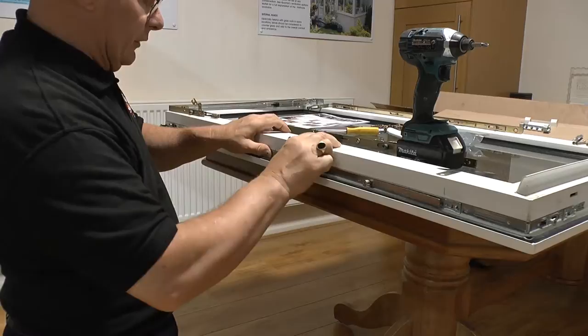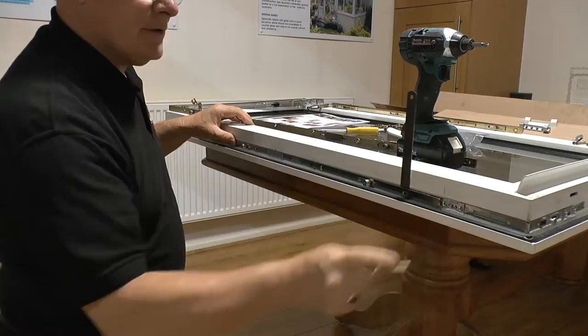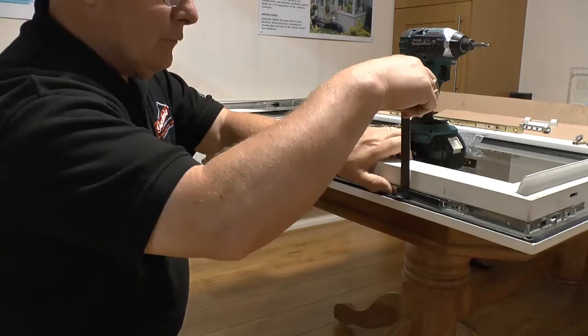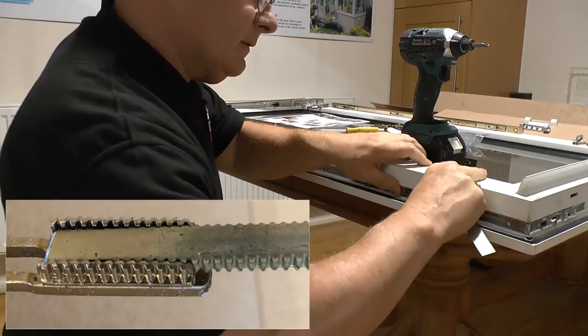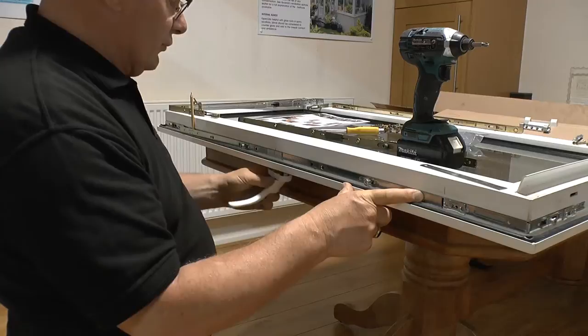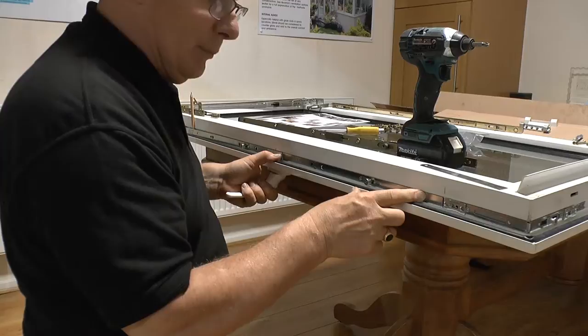A tip is always to drop something in behind the gear and make sure the slider is all the way back, and the same at the other side — maybe a pencil. Then one at a time remove the measure, and slowly try to latch the two teeth together behind the plate. It may be that at this point you may have to introduce the handle once more and just slightly wiggle it about until you hear the click — did you hear the click where the drive gear went in properly? And then slide the cover back over to trap it, and we do exactly the same at the other end.